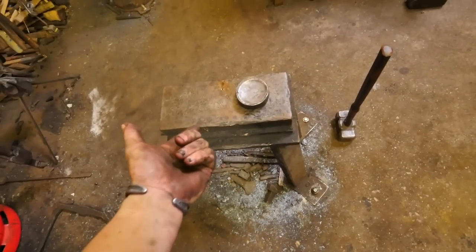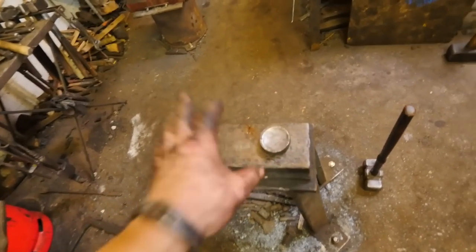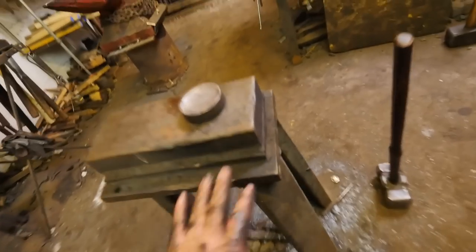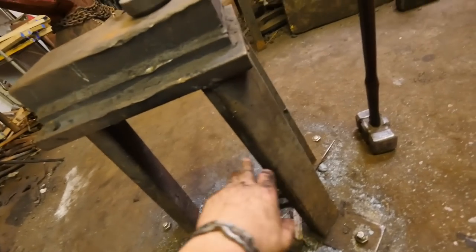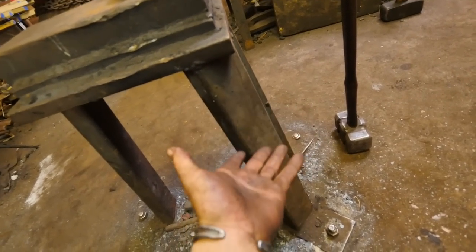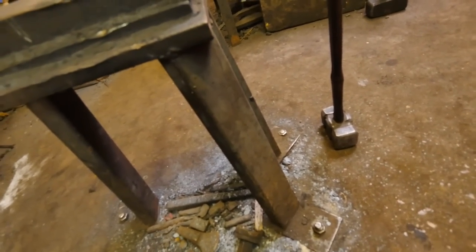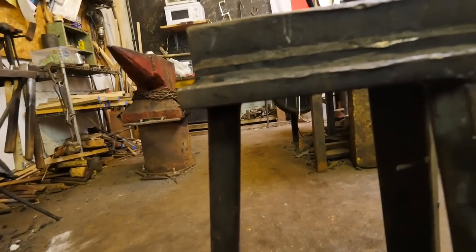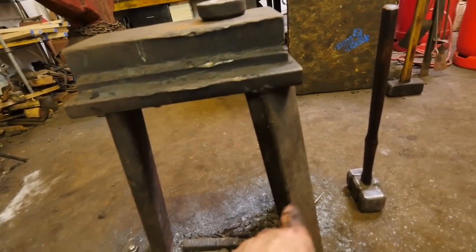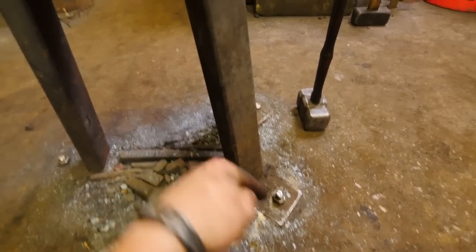So how do you make one of these striking anvils? I'm going to be getting some top plates cut out so you'll be able to buy them from me — I'll let you know when that is, so make sure you subscribe. From there, what we need is a plate — you can just roughly torch-cut a hole. Then it's on to the tubing for the legs. Make sure you use nothing less than 2-inch square tubing, preferably with a wall thickness no less than 3-16ths of an inch. This here is inch-and-a-half by 3-inch wide material with a quarter-inch wall thickness. You don't want to cut the legs at any more than a 10-degree angle, otherwise you end up getting too much flex in the legs. Fill the legs with sand to deaden the sound, and make sure the feet have some hefty holes for either staking into the dirt or bolting into the concrete.